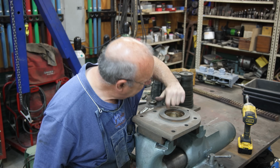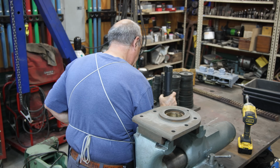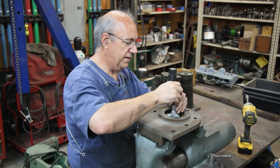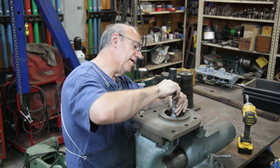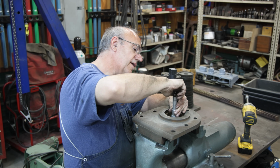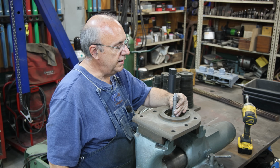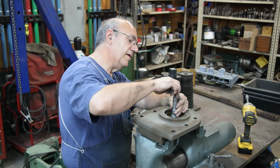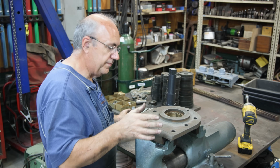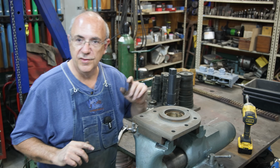and I'm just looking, and it's making contact in just a couple of places, which tells me that bearing may not have worn perfectly round. And just to make sure, I'm going to get a quick measurement here. I'm measuring on the areas that it looks like it was cut in about 3 places, and I'm still just a little bit undersized. So anyway, we're going to make an adjustment to the reamer. It's going to be back and forth until we get it where we want it. So let me go make that adjustment. I'll show you that, and then we'll come back and do another cut.